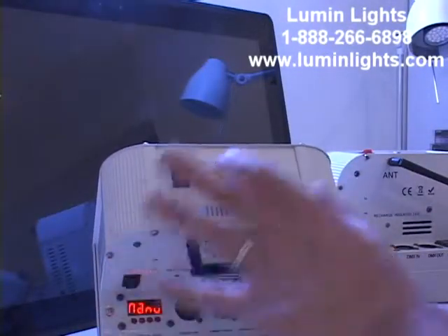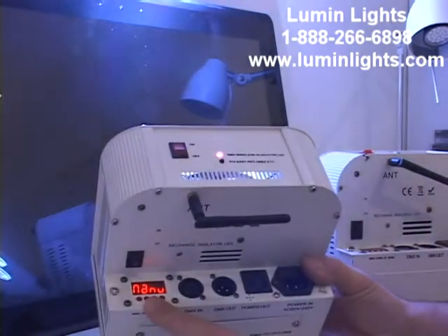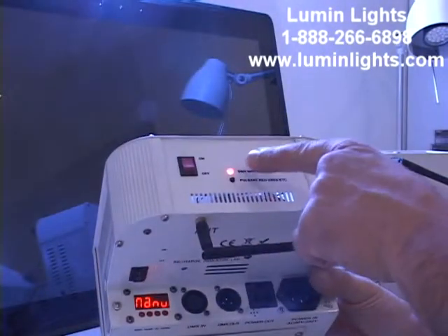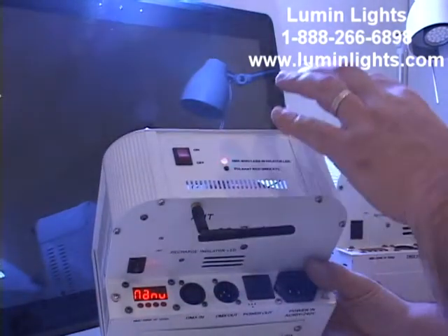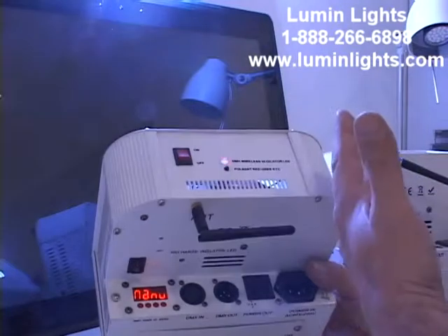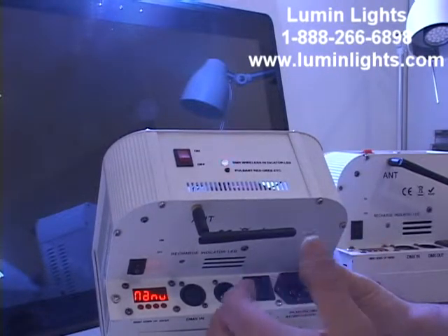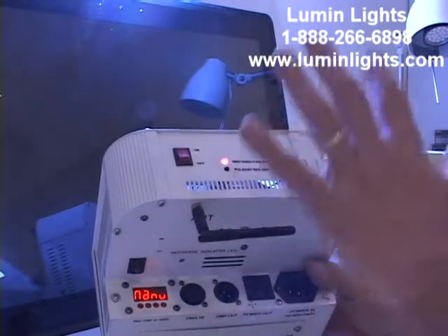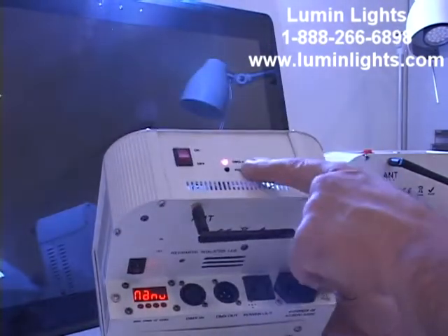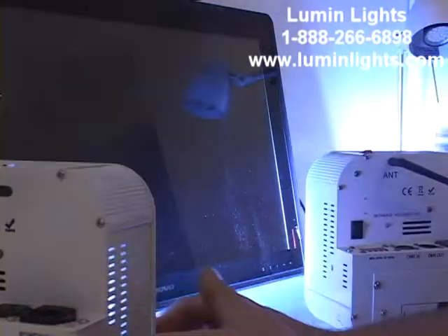Now let's talk about DMX. The DMX LED is blinking red — that's because the light is in master mode. In master mode, the light says 'nobody is controlling me, I'll be in control.' If you turn on DMX, the light will actually output a DMX signal through its antenna. Whatever it's set to do — say white — it's broadcasting DMX telling any other lights it's controlling to turn white. This is great if you don't have a DMX controller: set the first light to master mode and a color, and it broadcasts that color.